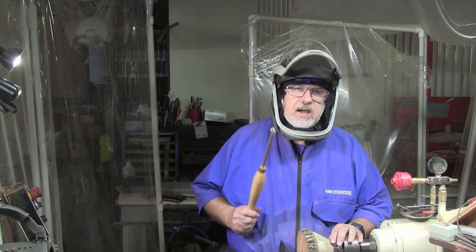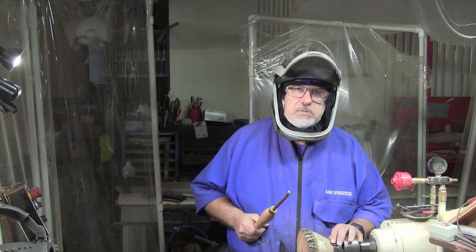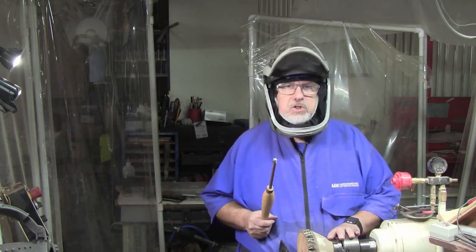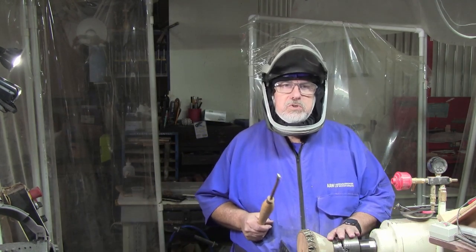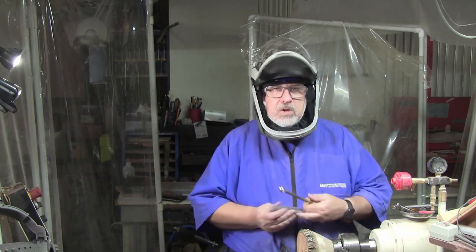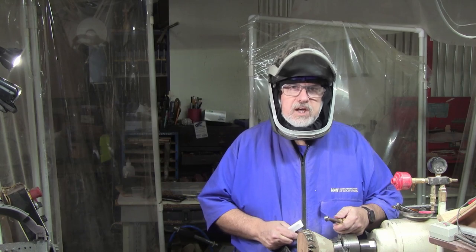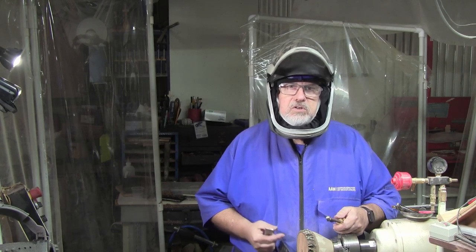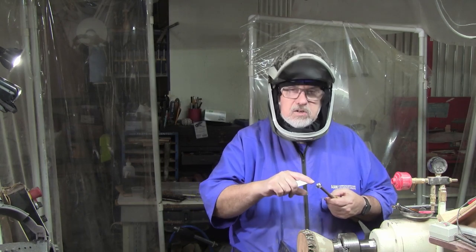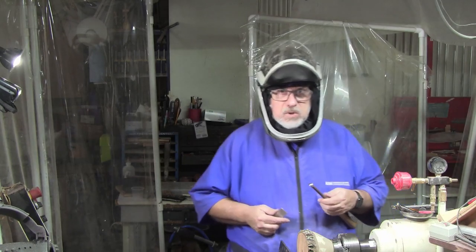So understand, I do not set myself up as an expert or even really knowledgeable on the Robert Sorby ring tool. I have done a little bit of research and I will show you how they told me to sharpen it. After doing quite a bit of research, I finally found a document on Robert Sorby's website, and it said to sharpen it, don't grind it. If it gets really bad, you can take a conical grinding stone and put it in the middle, and that's supposedly not going to hurt it.